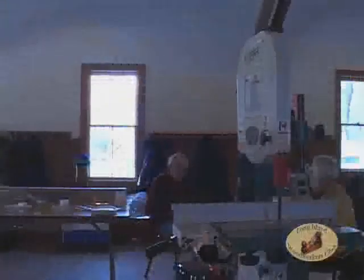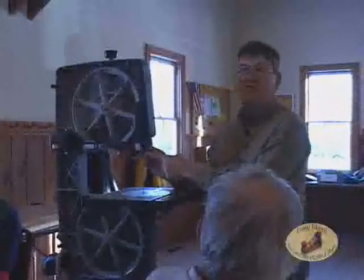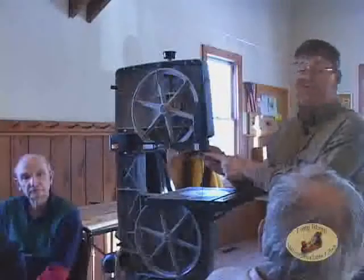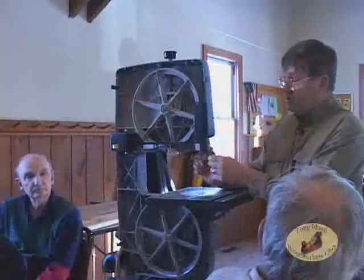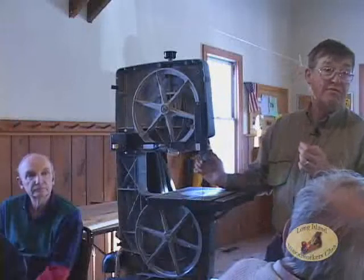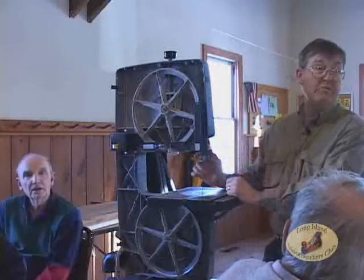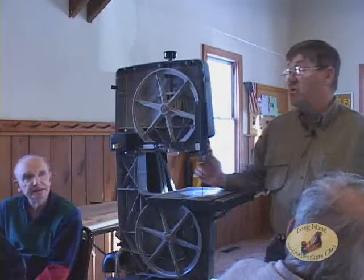Cool blocks or wood blocks in the guides are much better than metal ones, because the inexpensive metal guides tend to drift. You tighten things down and even then the back bearing drifts, the blade starts going back into the guides, and when it touches a steel guide it knocks all the set out of the blade — the blade is essentially toast. The nice part about wood guides or cool blocks is that the blade can cut into them without being harmed, so you don't lose the blade if the guides go a little out of adjustment.